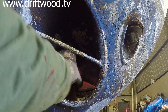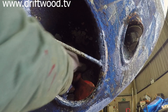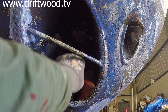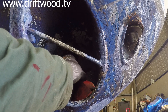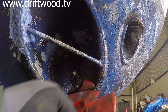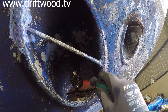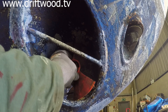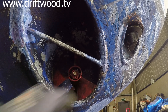Right up in the bow of the boat, just below the water line, there's a propeller called a bow thruster. It swings the bow of the boat left to right and is operated by an electric motor, but it's been a bit troublesome over the past few years. On more than one occasion the split pin in it has broken. It's one of those jobs you can only do when the boat is out of the water, because the split pin is actually below the water line. It means removing the entire propeller, putting a new pin in, and refitting it. It's a dead easy job out of the water but nigh on impossible to do when you're still floating.